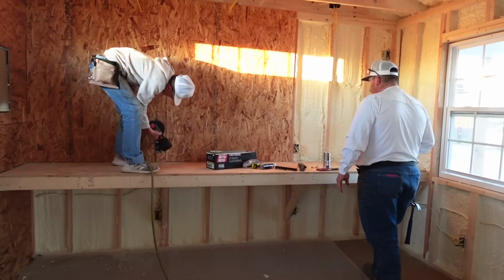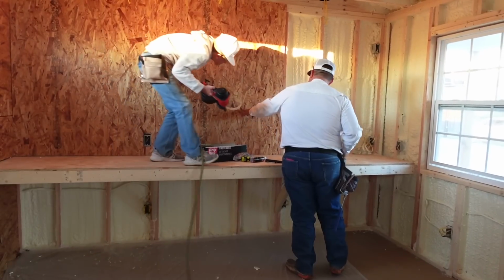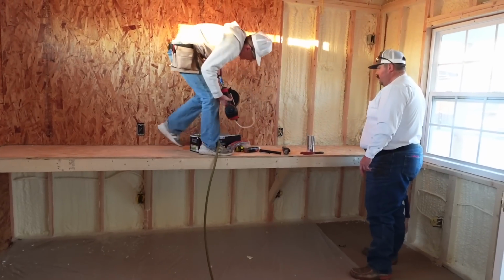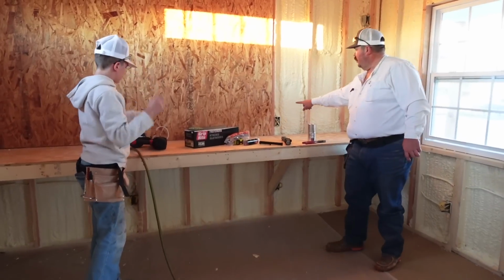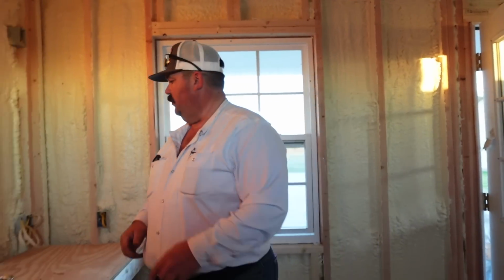Oh, we didn't even pay attention to where, hey, don't put any, yeah, don't go below that. Keep it kind of in line with the box so we don't hit it. Don't hit what? Well, right here where these wires run through the wall. If you shoot a nail in there, chance of nicking it, and we don't do that.